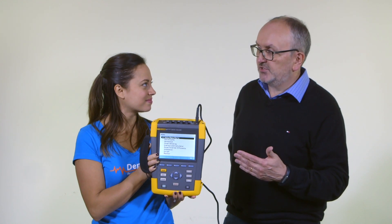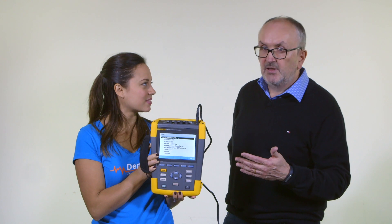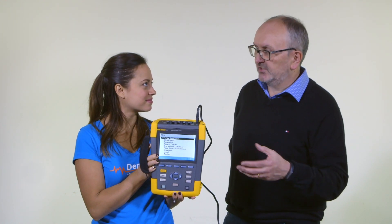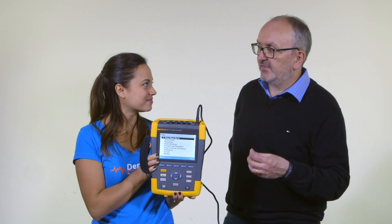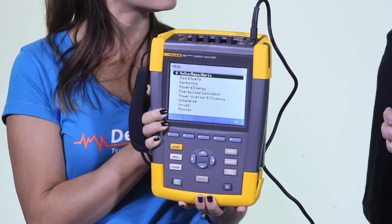In addition to that, we also have to add information about the design of the motor. The design information comes from NEMA — the National Electric Manufacturers Association — and includes things like the number of poles in the motor and the overall motor design. With that information we can then calculate those mechanical parameters that haven't been possible to calculate previously.